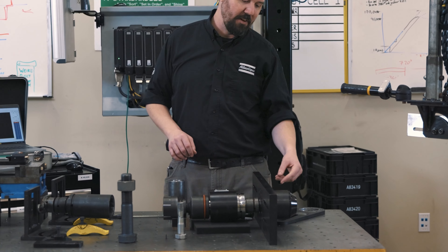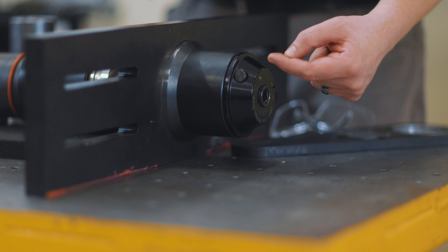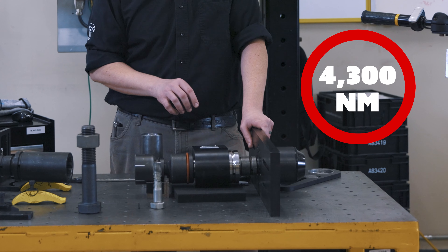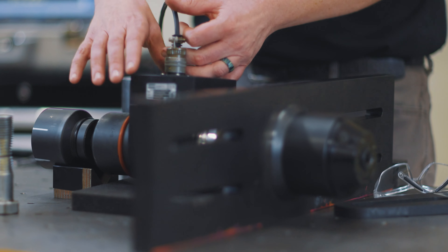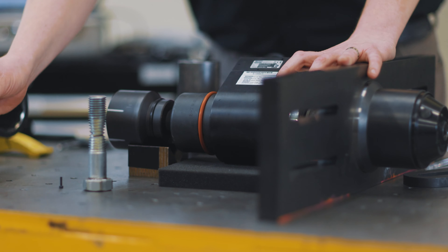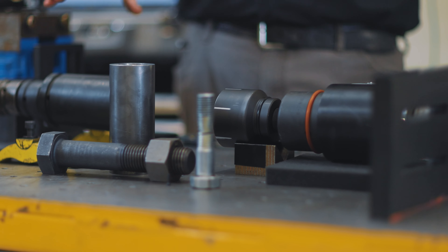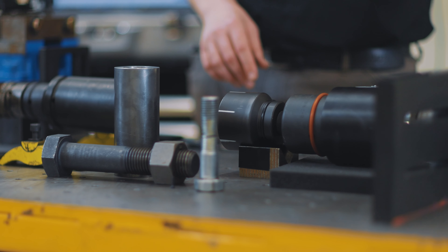Let's take a look at the setup to break this giant bolt. We start with a torque multiplier — a planetary gear set with a half-inch input drive. Torque goes in, gets amplified through the gear ratio, and can output up to 4300 newton meters if we need it. An external torque transducer reads the output torque and displays it on screen. Then we have our socket, tightening the bolt around a collar with the head backed up, all secured safely so we can apply enough torque to break the bolt.